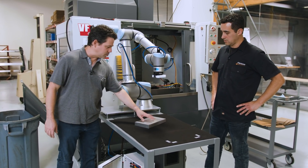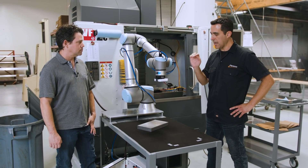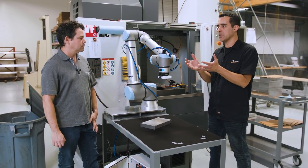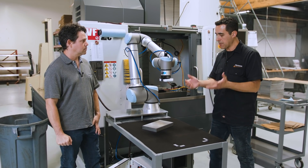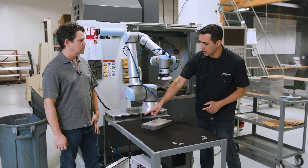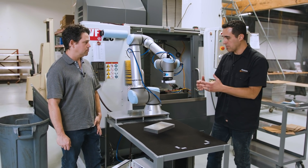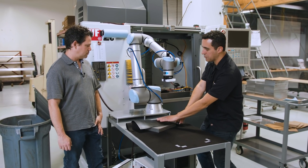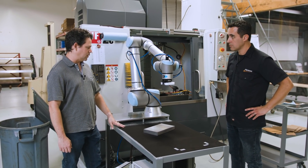Sometimes the robot camera would work and sometimes it wouldn't — the RoboT camera has been incredible, but every now and then it would not see the pallet or just not identify it. There was no way to go back and look at a snapshot to see what it identified. The camera was programmed to look for rectangular objects, but instead it was seeing shapes with round edges from lens flare or gloss. The mat was scuffed down but it really wasn't enough.